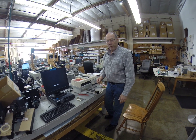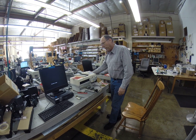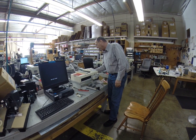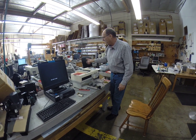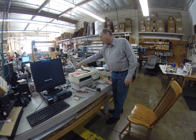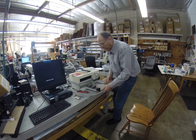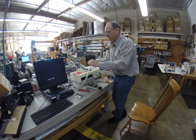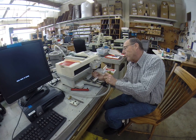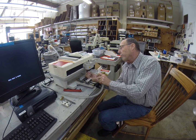Hi, I'm Fred with Quality One Engravers. I'm going to show you how to engrave on a Unica and do plastic engraving. I'm just going to flip it on. Back here is a chip removal system with a one gallon canister. And this is our Q&E nose assembly. I'm going to go ahead and screw that on the bottom of your spindle.